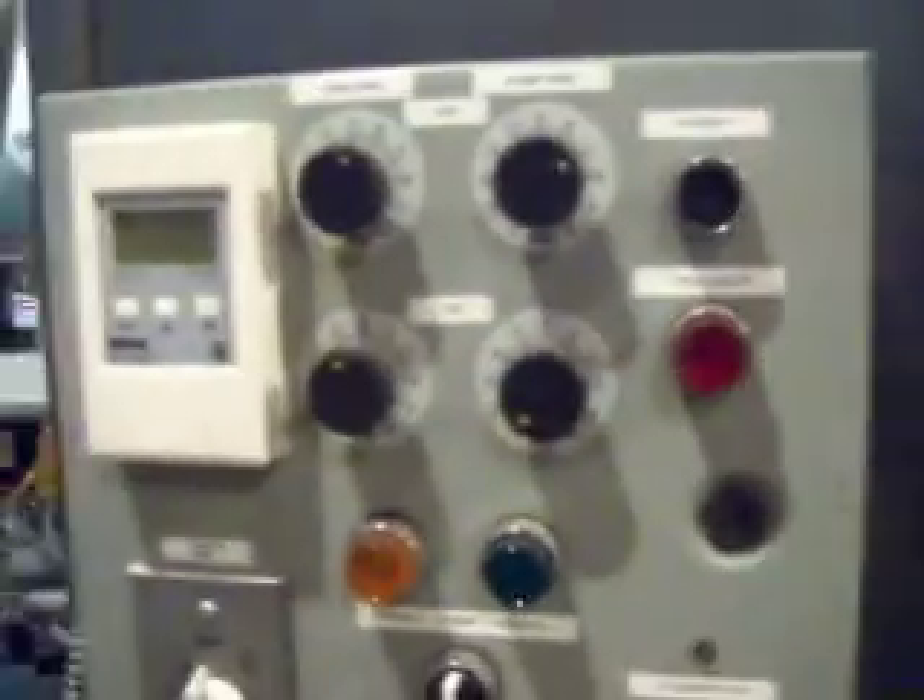Inside here there's a plastic door closing, a bunch of switches, two DC controllers, a power transformer, and a bunch of relays. The DC controllers control the speeds of the DC motors — there's one on the auger and one on the fan. The fan controller is currently sitting on the floor because it's not hooked to anything right now. I've got two different systems jury-rigged together and I'm just doing some testing. The boiler controller runs the system on low until heat is needed, then it kicks up to high — speeds up the auger and speeds up the blower.